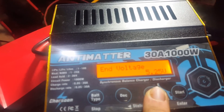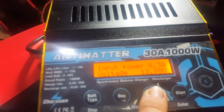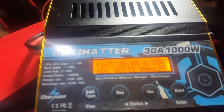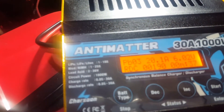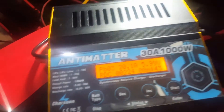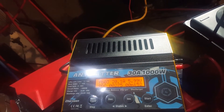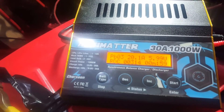It's going to stop at 5.25 volts. It's pushing 8.3 amps back into the 12-volt battery bank. It's holding 20 amps and the milliamp hours is jumping up like a rocket, which is good. We should have a better idea of what's going on by the morning.